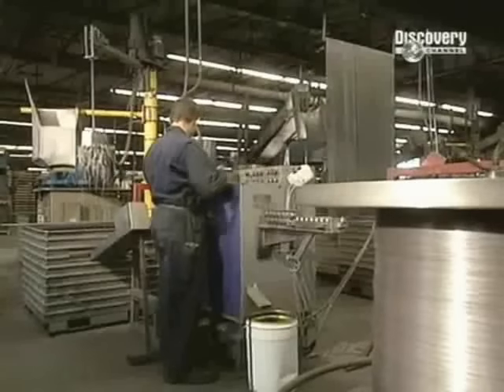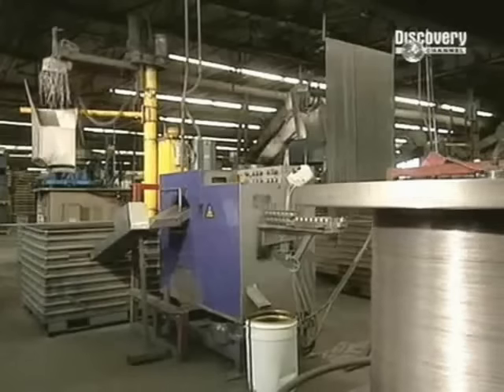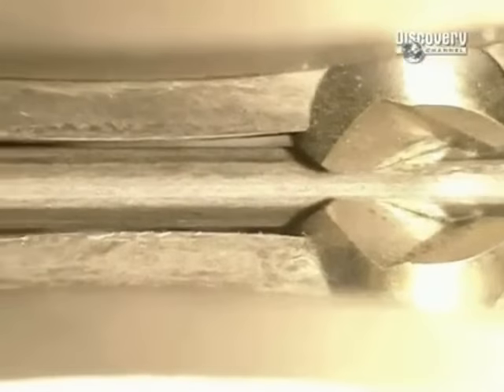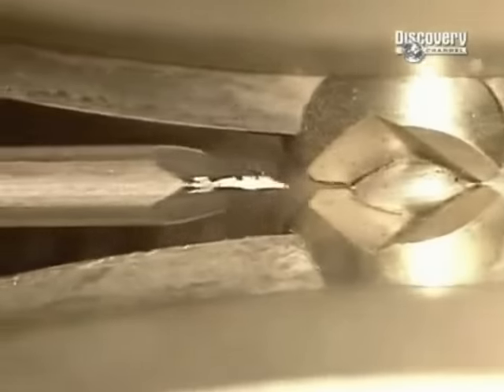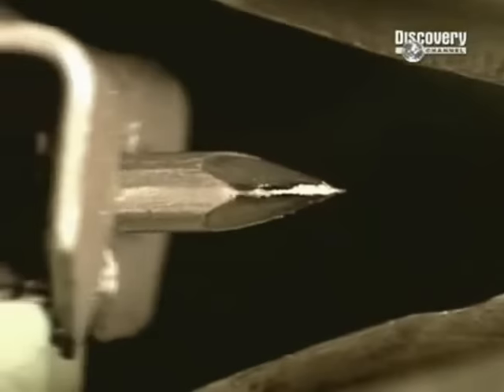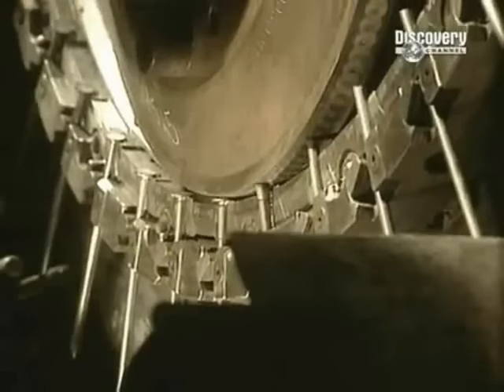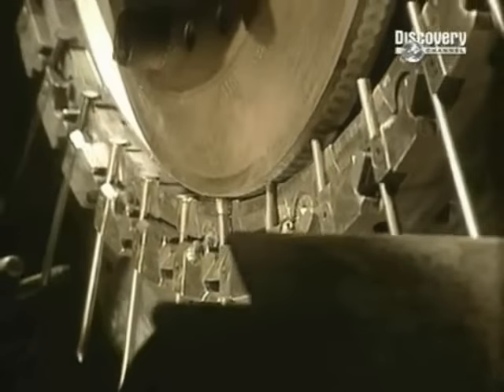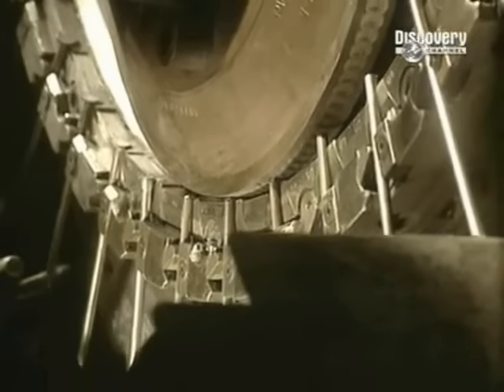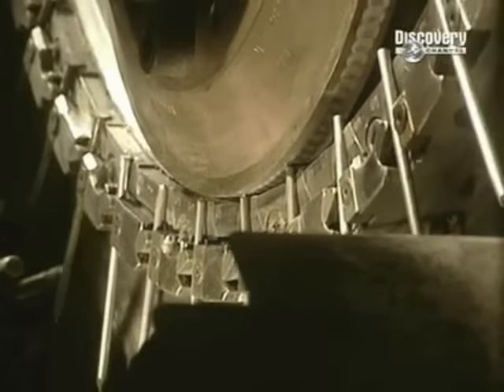It's now cut into small rods. The cut rods are gathered up with this electromagnet and dumped into a machine that will process them. The rods are turned into nails by a blade that forms the nail's point. This machine forms nail heads by flattening them using great pressure on the rod ends, at a rate of 1,400 per minute.